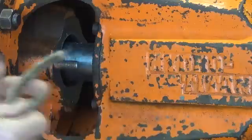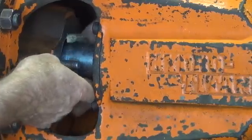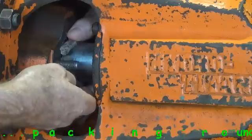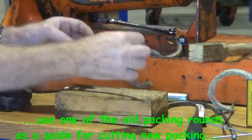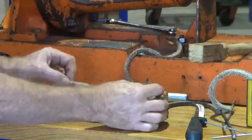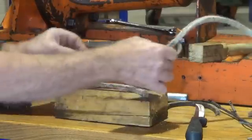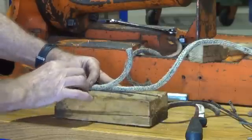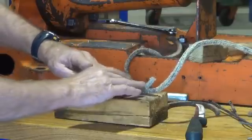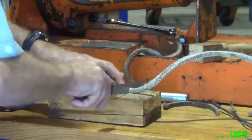Now what we've got to do is make up some new rounds of packing. I'm going to use one of the old rounds — it's important when they fit in that you have a nice neat butt-up on the ends so that there is no path or gap for leakage and for water under pressure to come through. So I'm going to use one of the old pieces of packing, pull out the new packing, and just lay it along the length of that to measure it. Make sure you've got a nice sharp knife and just cut it — slice it through and it gives a nice square end on it.